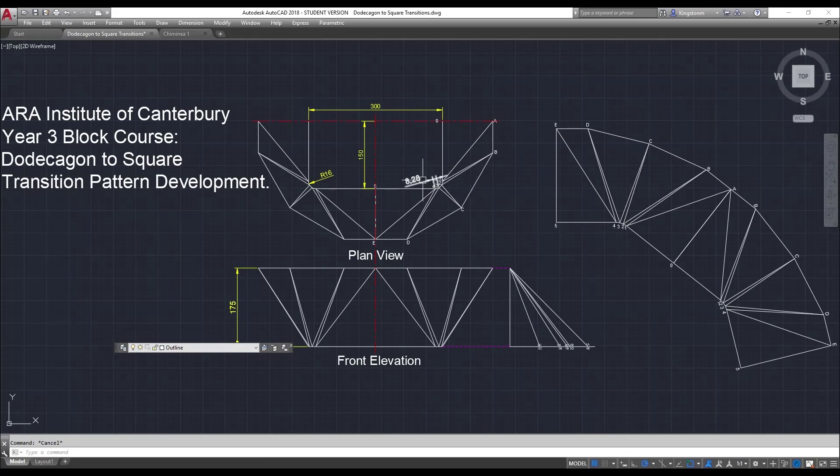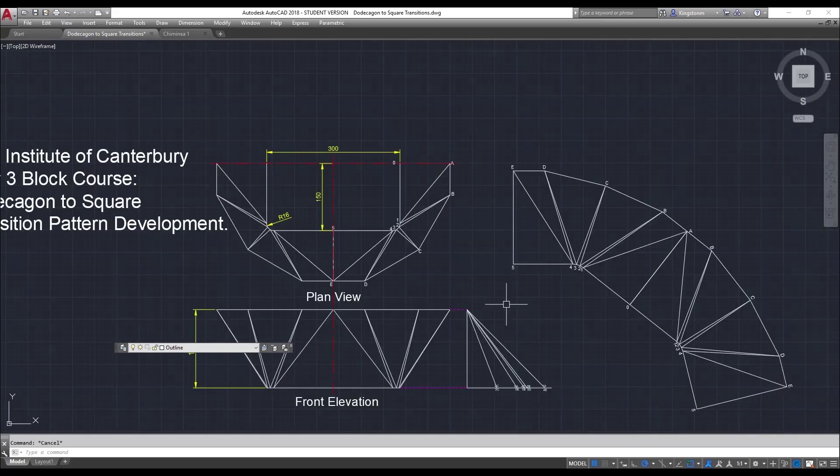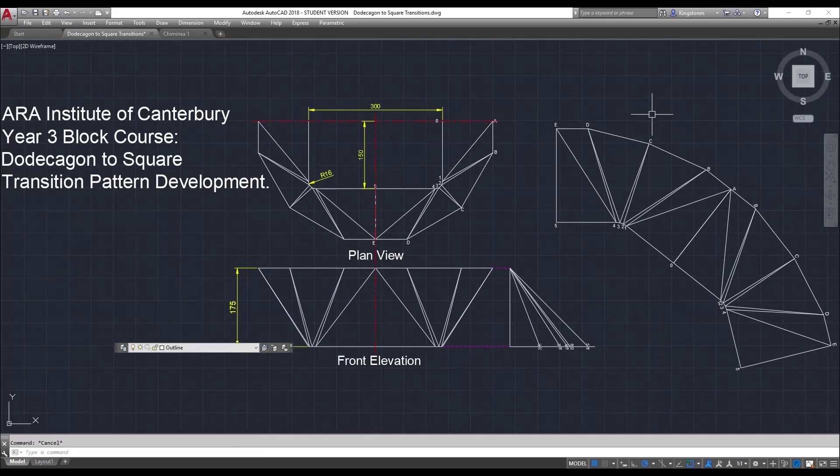With the radius corners, you can see that the radius is quite tight down on the corners. But if you get it all right, your final corners should be 90 degrees — these two corners should be 90 degrees, which means the ones in here were also 90. That's how you would lay out your pattern, with a joint line going on this little line from zero to A on both sides, down through the middle. You need to watch this video a few times to get conversant and confident with it, for day one when you come to mark out your pattern.